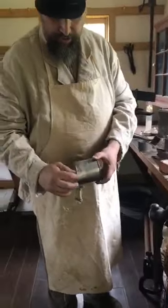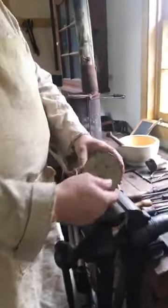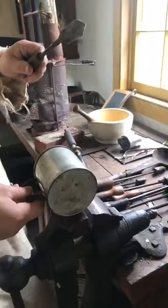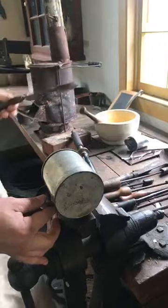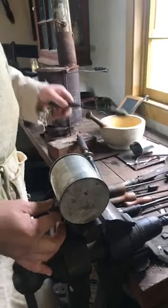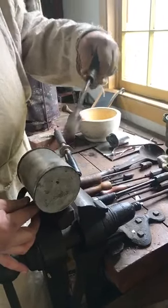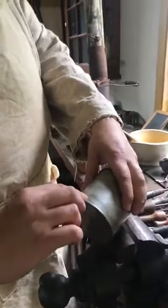We look at the end of the cup, like we showed earlier. We grind up the flux. We can turn it into a liquid with a little bit of alcohol. We paste it around the edge of the cup. And then we'll heat it with the copper. What we'll do is touch the copper to the flux, then we touch it to the solder, and then we touch the solder on the copper to the edge of the cup. And it'll actually flow, which means the flux will allow the solder to flow through the joint by what's called capillary action.